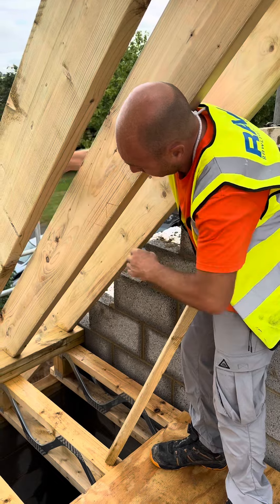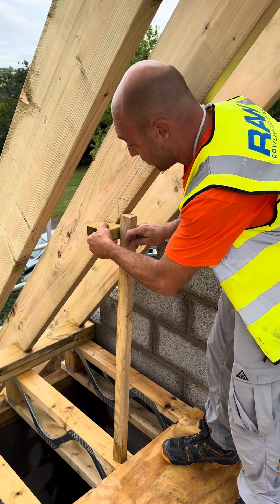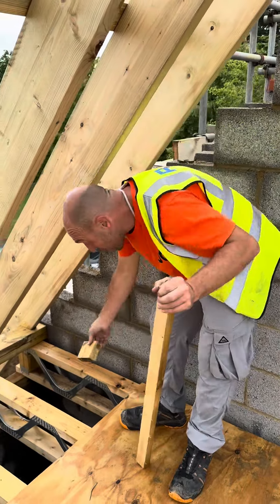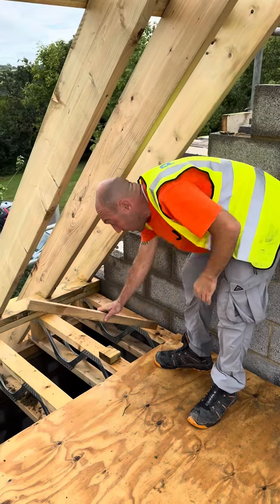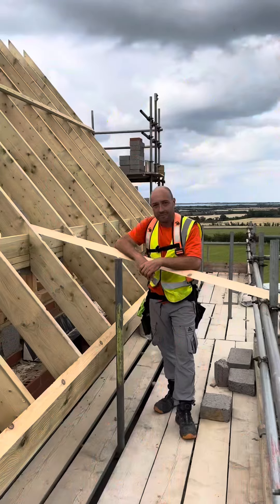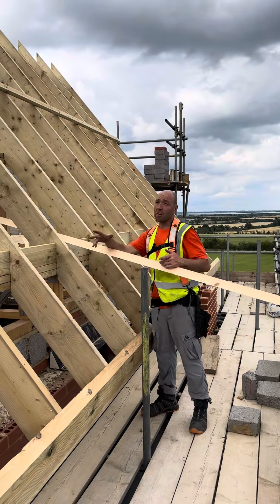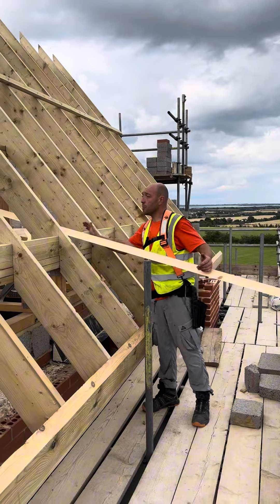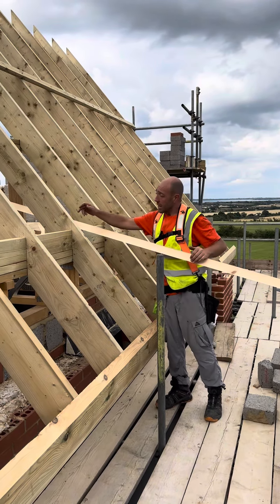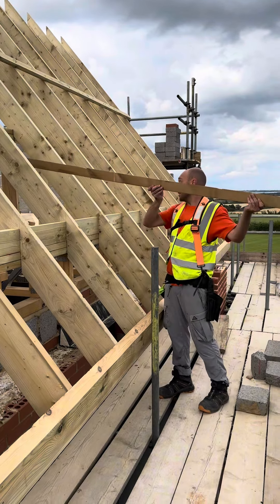What we do is brace these rafters out. I put a timber underneath the rafters, tight, and draw the backs of the 4x2 either side of the rafter. When I fix that up, it pulls all the rafters nicely in line and takes out any differences in the timber. Also, if it holds them parallel, it works really nicely with your plasterboard lines and all the insulation you're going to cut in between. And when I do my timber walls, the stud walls, I do the same thing — mark it at the bottom, then all the studs underneath the rafters are all the same.